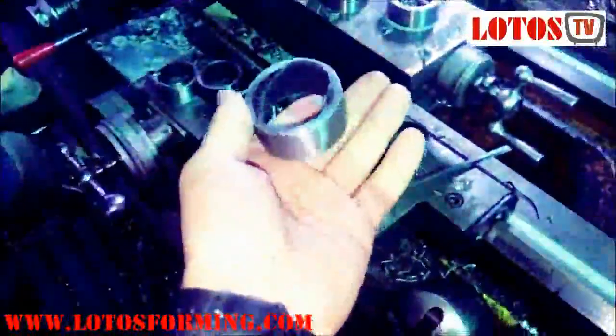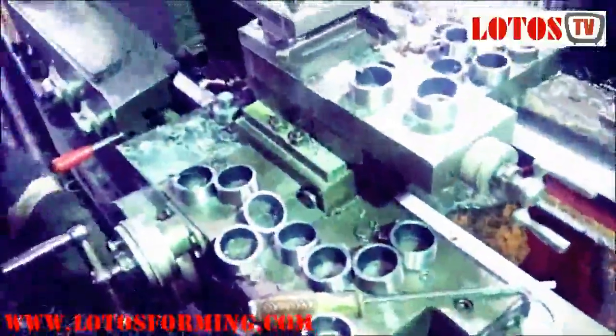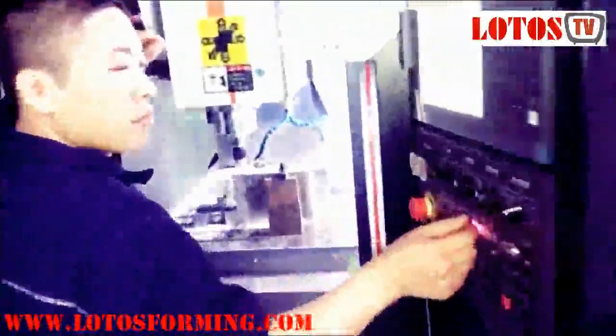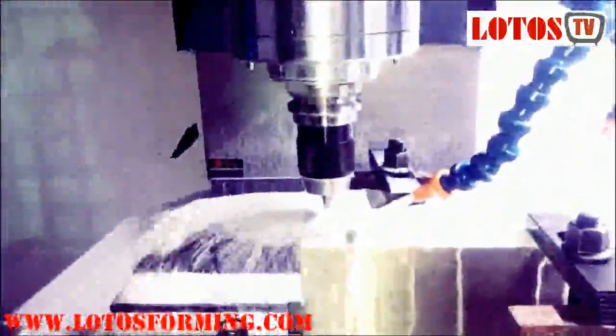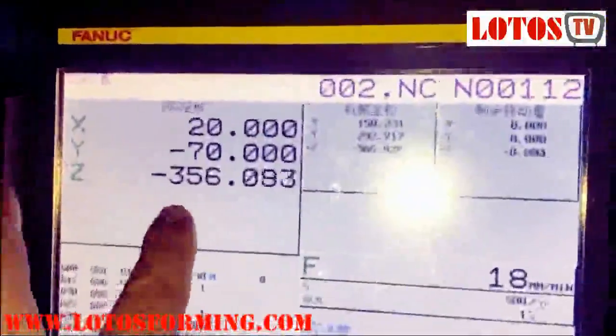What's the length here — 13 millimeter, the tolerance is 0.2. It's a little hot, but I'll show you later — it's going to surface treatment, so this extra part will be taken off. Let me go to the secondary step with CNC machining.